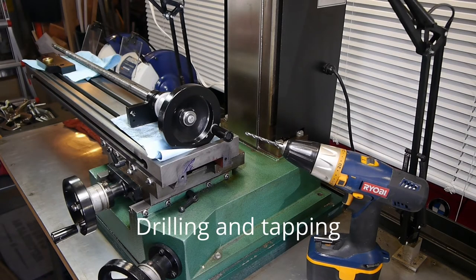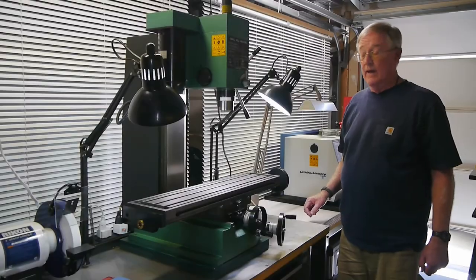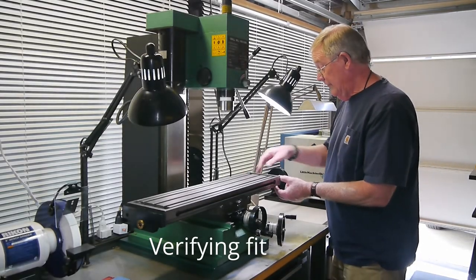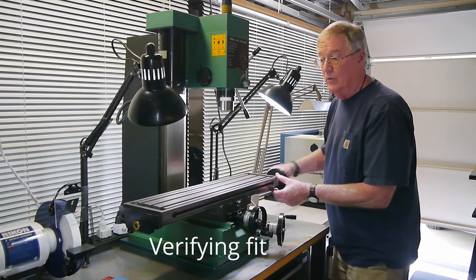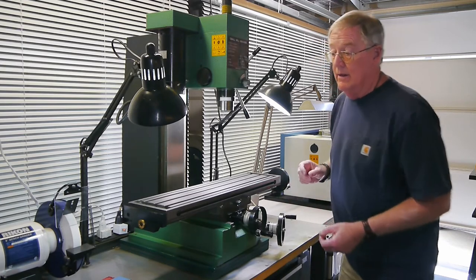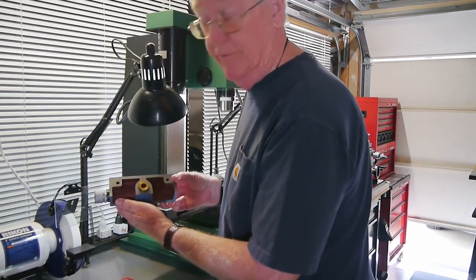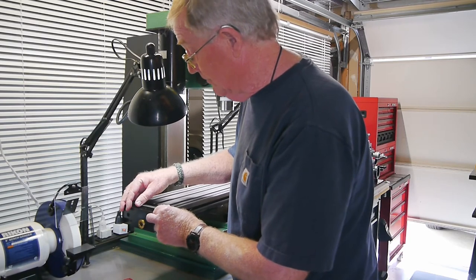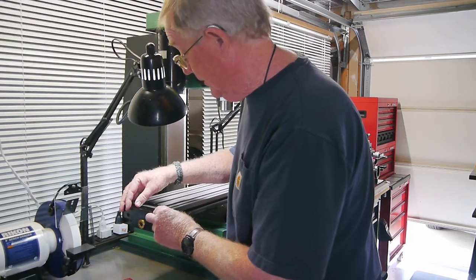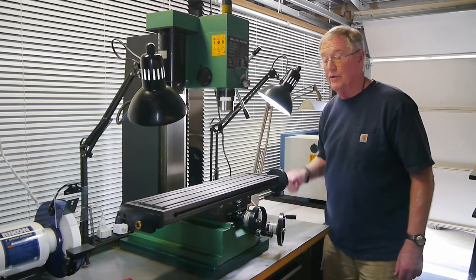To drill the holes, the first step is to remove the lead screw to expose the marks that were made during the mock-up clamping process. Here the location of the holes is shown prior to threading. After I drilled and tapped the end of the milling table, I fixed the end plate with the bearings and with the handle, then ensured that it traversed cleanly with the end plate mounted. I then drilled and tapped the other end as well. I used an end plate rather than just the clutch from the power feed because clamping the clutch directly was too awkward to test the fit. At this point, I've got very smooth traversal and this should work really well with the power feed.